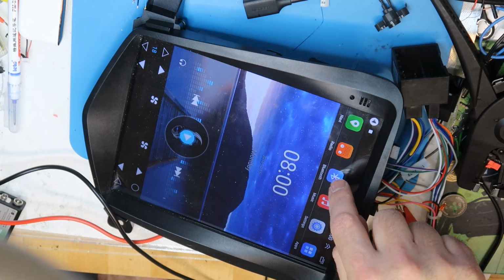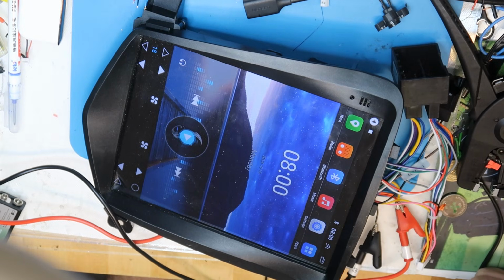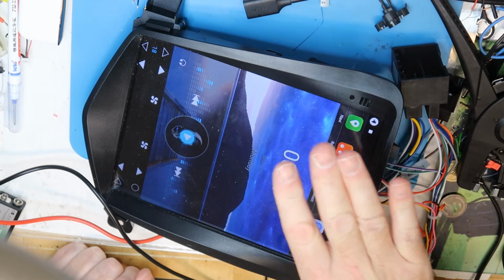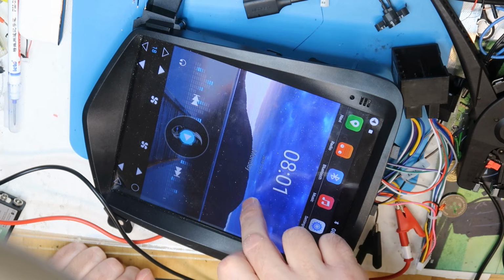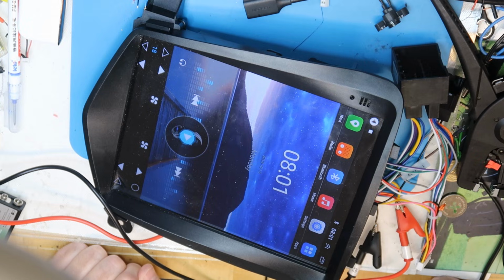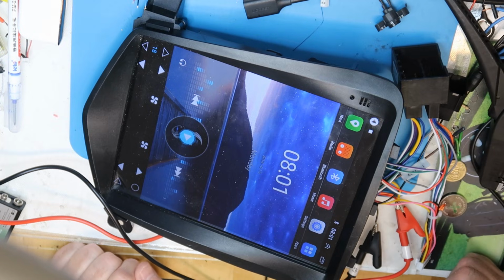Okay, now about the touch screen. All the touch screens basically have the same method of work. Like in your iPhone or Galaxy, you have the screen, and then you have something that is called a digitizer. The digitizer is another layer that is on the top of the LCD, and it senses the finger and sends the location that you actually press. This is a capacitive touch, as for today, I think so. This is what I know anyway.